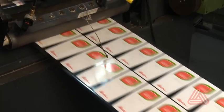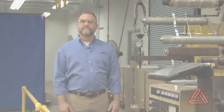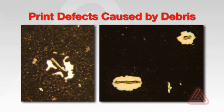The final step in preparation is making sure you have controls in place for the static electricity that film materials tend to generate. Static attracts debris from the air and floor around your press to the web, creating print defects. Static can also cause the web to wrap rollers in your press, resulting in print registration issues. This is particularly important when working with films, as you will also be using lower web tension in the press than you would for a paper liner.